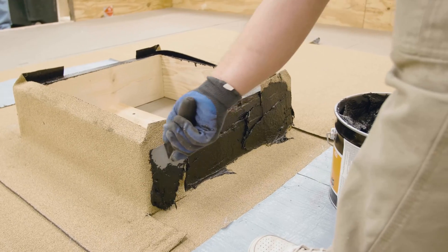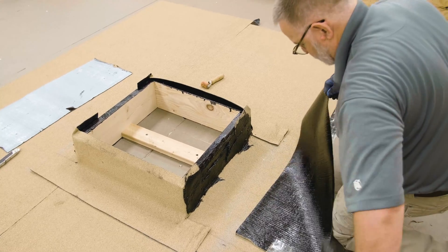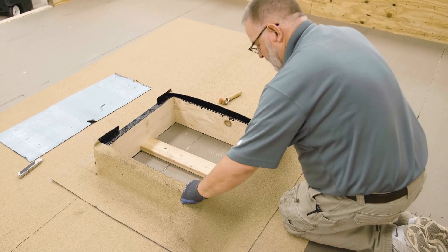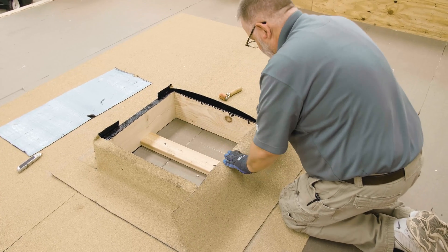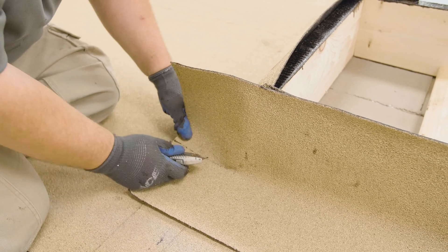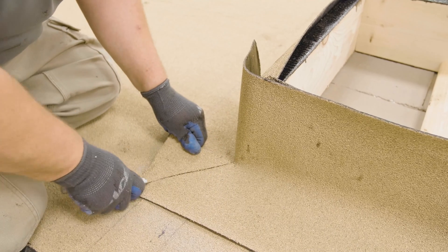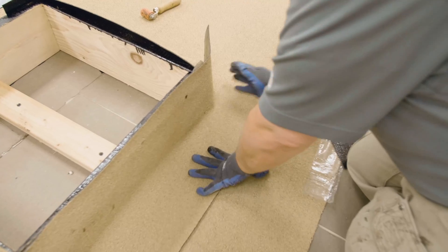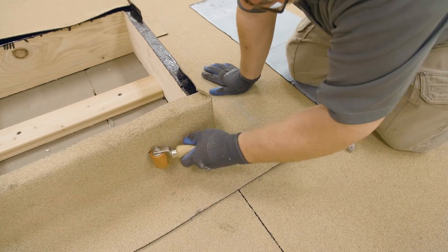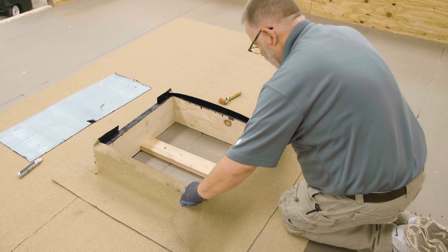Apply Mule Hide 421 mod bit adhesive over vertical granules on the corners that were just installed. Remove the release liner from the piece of flashing and carefully set the edge of the flashing along the reference line on the remaining sides. Use hand pressure to set the flashing sheet to the curb. Trim the top piece of flashing and wrap it around the side of the curb a minimum of 3 inches. Trim the horizontal flange at a 45-degree angle from the corner. Leave the excess beyond the edge of the curb until you are ready to complete the seam. Roll the entire curb to remove any air and ensure a proper bond. Repeat the process for the last remaining side of the curb.